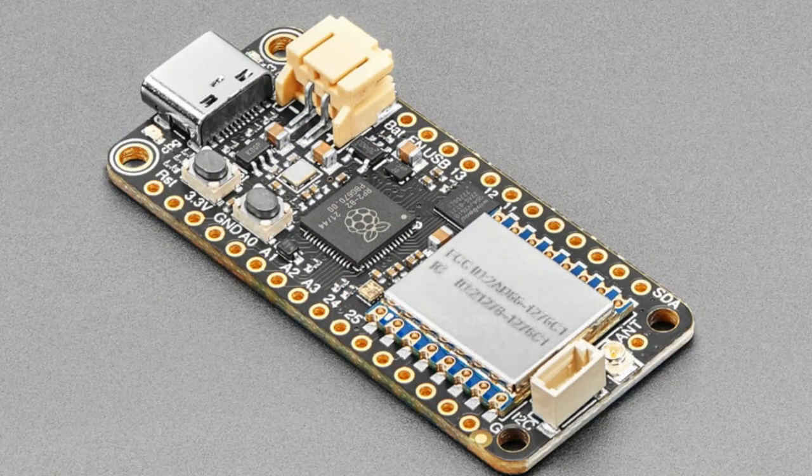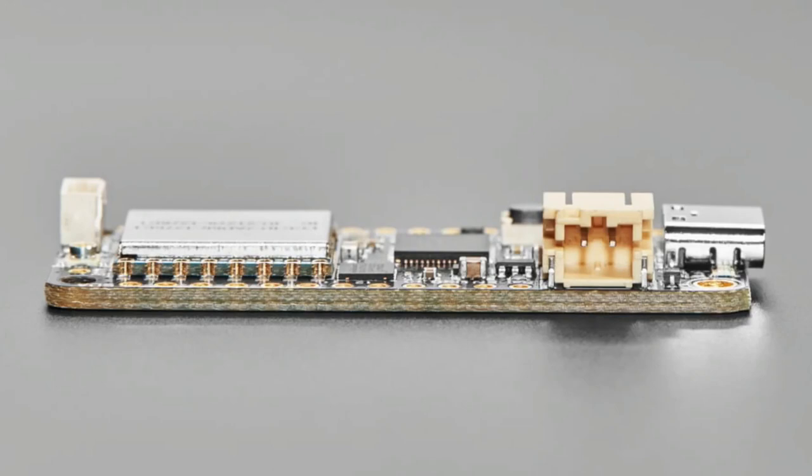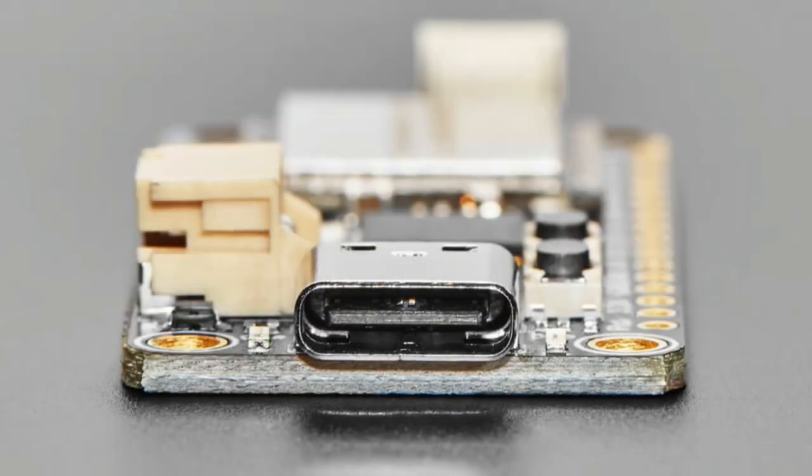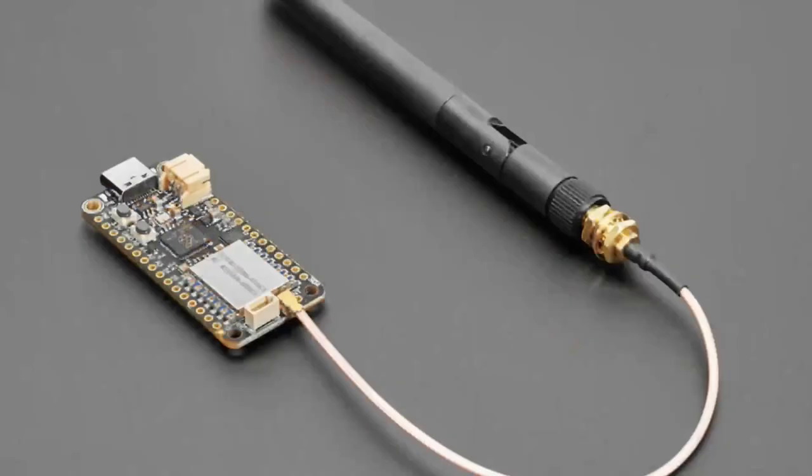You can run LoRaWAN on it. LoRaWAN is a software stack that uses the LoRa protocol. There's LoRaWAN stacks, I think, for Arduino and Pico SDK. Not for CircuitPython at this time, but you can just use LoRa as a long-range wireless. These are more expensive than the RFM69 series. They're like $5-$10 more because they use this proprietary LoRa chipset. It goes farther. If you don't need that distance or you don't need LoRaWAN support, RFM69 works really great. And again, it's cheaper, but if you want to talk to the Things Network or the Helium network or whatever that uses LoRa, or Sidewalk, I think, is also LoRa sub-gigahertz, you need to have a radio that has that proprietary radio modulation.